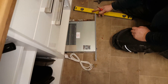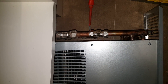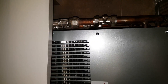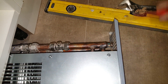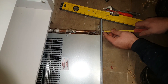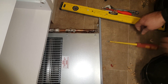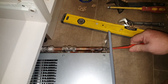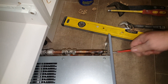Let's just see if we've got any leaks. Turn the service valve on. Turn the service valve on. Nothing there. Then we've got a bleed valve here, which I need a bigger screwdriver for. I've just got a bigger screwdriver and it's too big. So it's just going to bleed it. Here's the air coming out of the system. And that's it. Lovely.